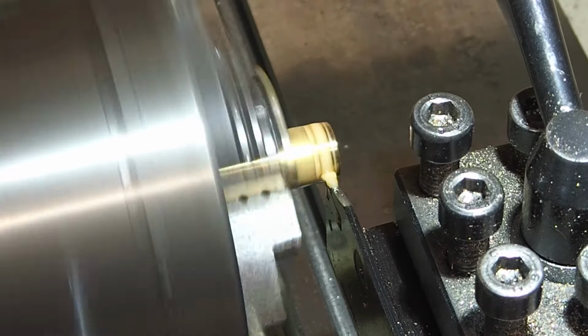I've changed out the three-jaw chuck for a collet. This is so I can hold the shaft of the adjusting nut without risk putting any chuck marks on it. After all, having just polished it up, I don't want to risk putting any marks on it.